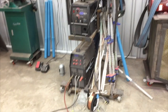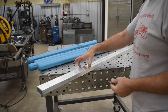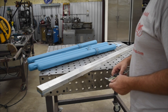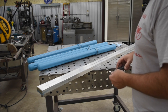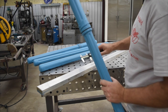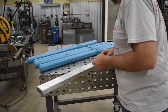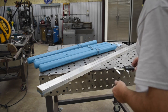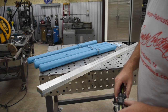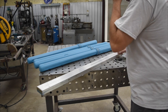This is going to be a pretty simple project. We're going to use some aluminum bar stock — one inch thick, about two and a half inches wide. I originally bought this to make a sign for the Shut Your Face Garage crew, and this is what I had left over. The tube is two inches wide, so we're going to need to put some two-inch holes in it. Then we're going to make a bracket and weld it, probably out of some 3/8 inch — that'll give us a chance to use our 50/50 mix bottle of argon and helium that I recently got and haven't used yet, been waiting for the right project to weld some thick aluminum.